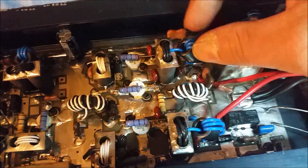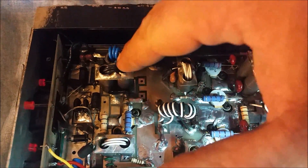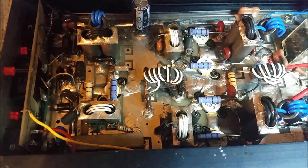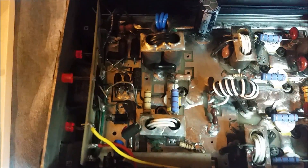I went in and did my little circuit change — beefed up the power distribution on all the transformers. Went from the original wiring, which is purely adequate with a short run, but it just makes me feel better to upgrade the feed to the transformers. As I do with all these amps, I thickened up the bus bar all the way to the driver. You've got pretty much thin foil carrying DC current to the driver. We're dealing with DC, not AC at this point — AC runs on a skin effect, DC does not. I always like to thicken that up and thicken the solder on all the pads — that makes it stiffer so more amperage can run.